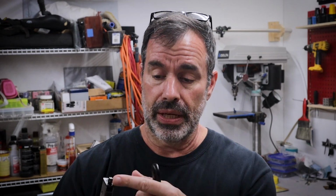Somebody knows the answer. It's just to clean up the cut a little bit, so when the fret wire slides through, it won't be damaging the player side of the fret wire. And this cutting plunger will actually cut away the tang.